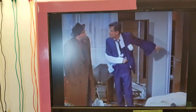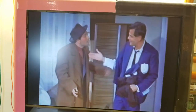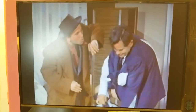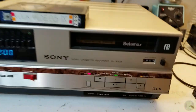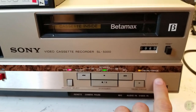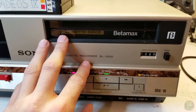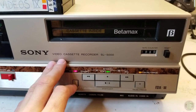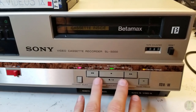Let's try the PCM switch. Does nothing - PCM switch did absolutely nothing there. So I think there's just a bit of video stabilization or correction circuitry in here that might mess with PCM audio because you want a direct feed and to do your own error correction, and the same thing with captions it might interfere - so that's just a switch to turn that on and off.